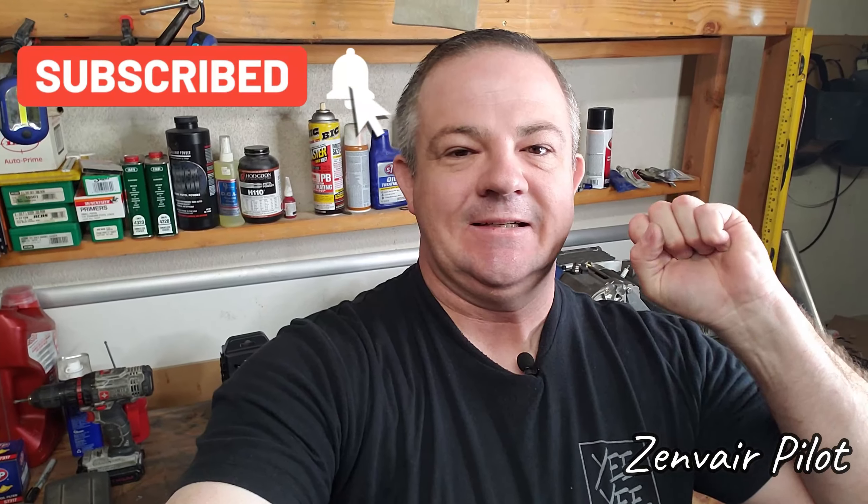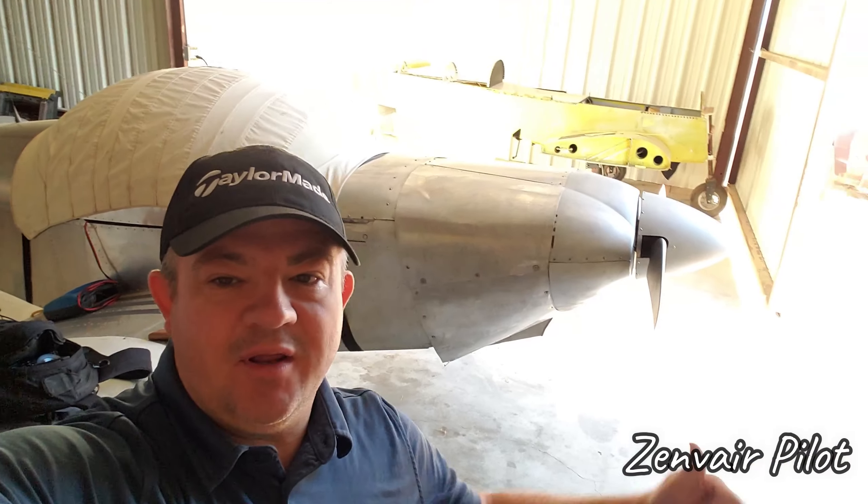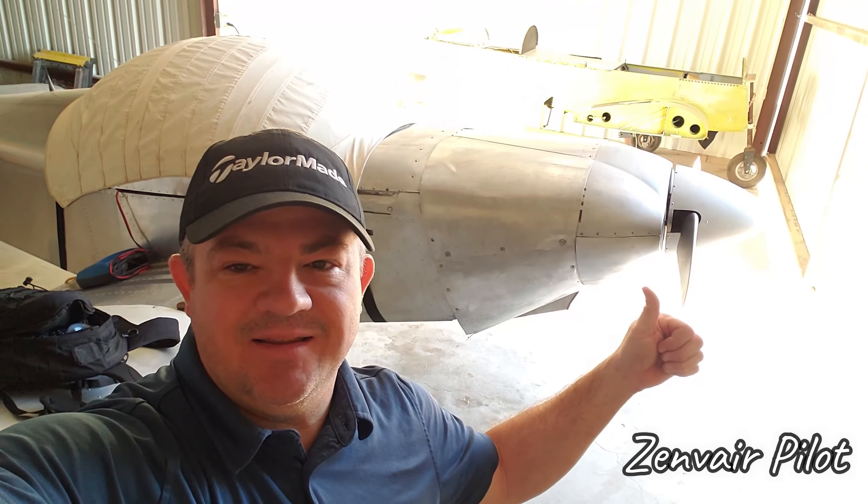Hey everybody and welcome back to my garage. I am Larry Nelson and here I am working again on my budget Corvair build. Now if you looked in the last video and followed anything on Facebook, you'll notice that I made a mistake. I'm going to own up to it and need to do the repair. What I did was I did an incorrect adjustment of the valves — not how I adjusted the lash, but how I put in the lock nuts. I came out here and did this engine already. So now that I've already done it to that engine using what we like to call the right way, let's get started on this engine and get this one ready to go so that it's in just the same condition as the one I got on my airplane.